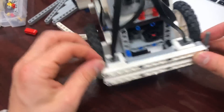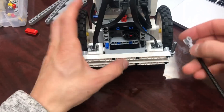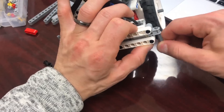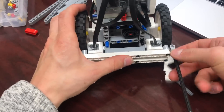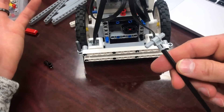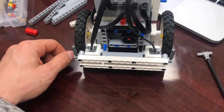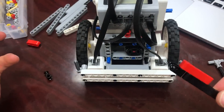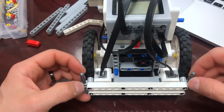Now I have two points to connect stuff to. The reason I don't use a regular three-axle is that without the stopper, if you pull up on it in a hurry it could come out and you'd lose time putting it back in. With the stopper on the bottom, it stays attached to the robot. And if you need to push something and turn with it, you can make a passive attachment with an arm that you can pull off and swap out very quickly — a really neat modification.